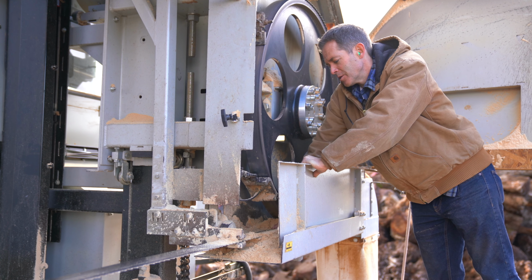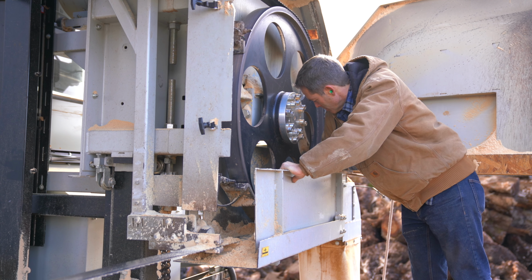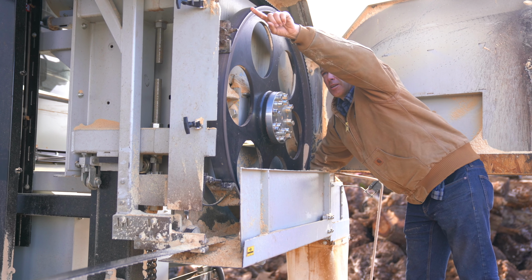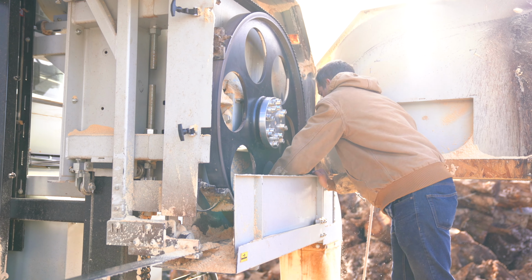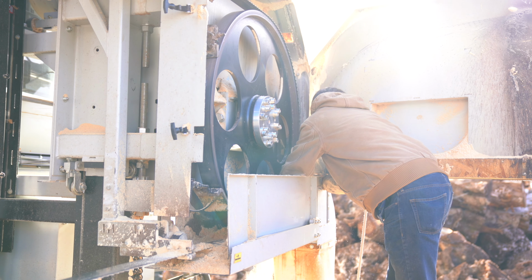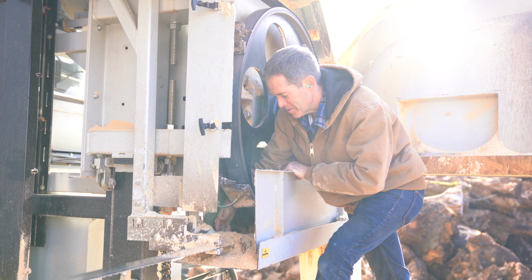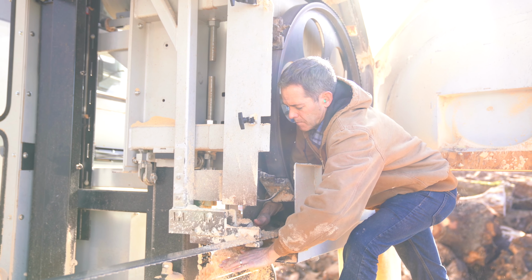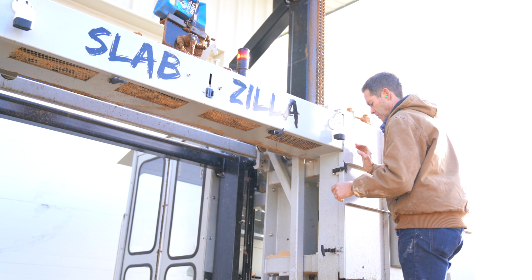You can kind of tell when the chute gets plugged up, or the exhaust over here. One, it stops dropping it out down below. But second, it starts dragging it over the top and you start getting sawdust kind of coming down halfway through. So that's pretty good there. With some species, I never have to do this. This one, I think there was a lot of sap inside of the last log that we did. So. Give it a shot.